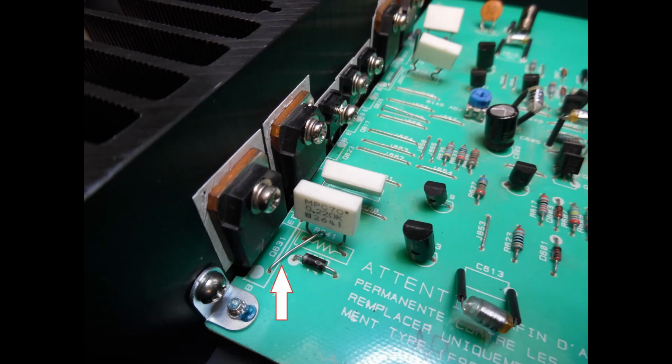So in terms of putting back or fixing, just be aware that sometimes with these amplifiers, these wire links are cut very, very short when they come through the board, and they're not looped over, so they're not held in position. They're still just pushed through. And it's very easy to have something like this occur. This is the point that whenever you undertake any repair work, spend a little bit of extra time to verify your work and ensure that there's nothing else that's a problem.